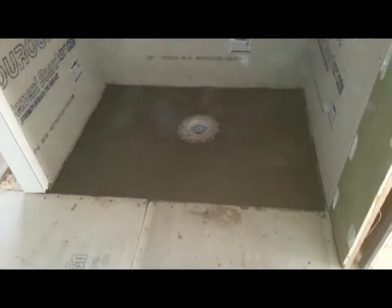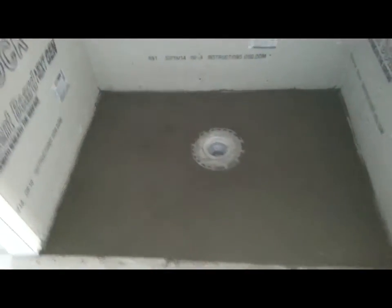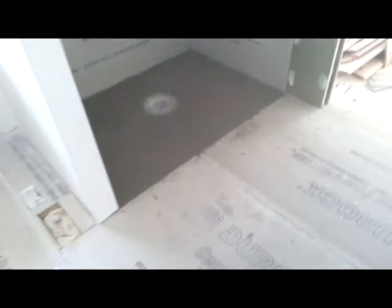That concludes part one of our video on how to do a roll-in curbless shower without removing any structure in the home. The system we worked on today was framed up with 2x10s — it is pretty easy to add a sister 2x8 beside them, cut two inches out of the 2x10 and reduce your shower floor that way. But the obvious application for this method would be in a house with an open web truss system where you cannot cut the 2x4 off the top of the truss, as you lose all the truss structure. It also saved a lot of time — it's noon and we've been here three and a half hours with this thing done and ready for tile.